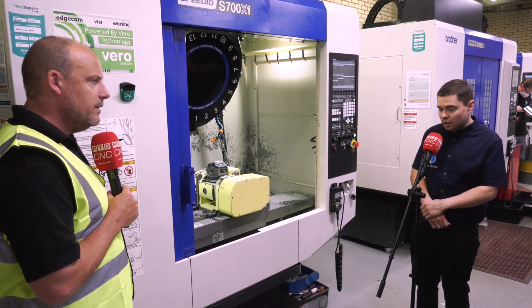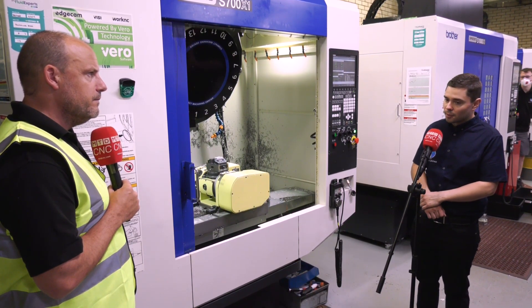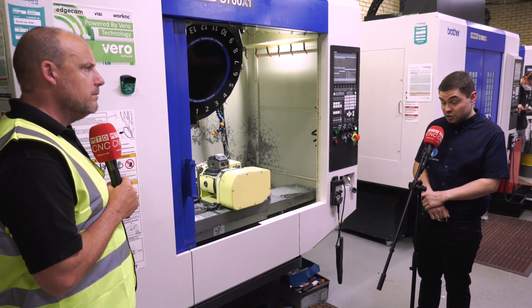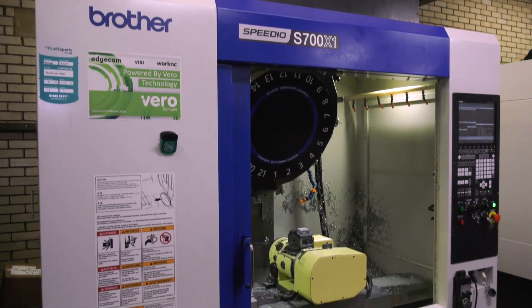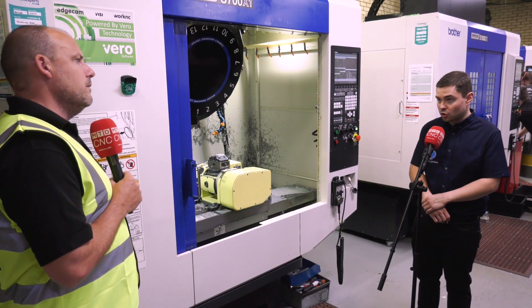What's the different style and approach? Do you have to look at the jobs differently? The tool paths need to be looked at and the way you attack the job. There are a lot of specialist cutters out there for doing high-speed aluminium machining on machining centres like these. It's based around small, light cuts as opposed to bigger, heavier cuts that you do with a larger style machine.